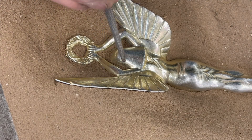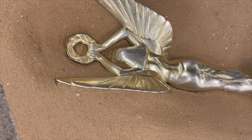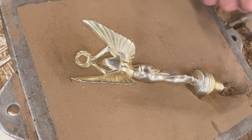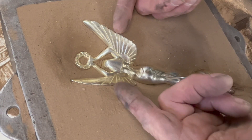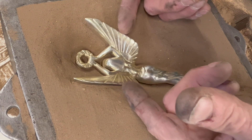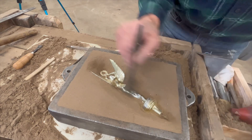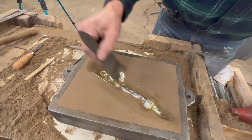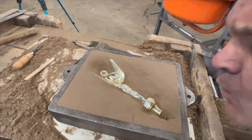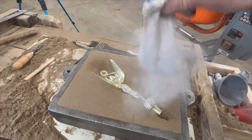I'm going to use the tail end of this little file to get that sand packed in as tight as I can in that little area. Now I'm going to loosely move her and pry the pattern out just a little, because I want to know it's going to come out before I go any further — and it looks like it will. I push her right back into the sand. Now I can move forward with the other flask. I take the paintbrush to clean things up, smooth out the mold, and blow out the loose sand — I don't want to use compressed air, as that could blow a big chunk of the mold away.